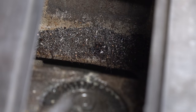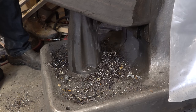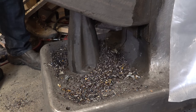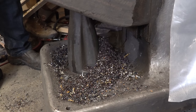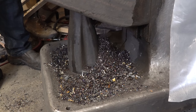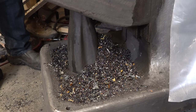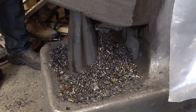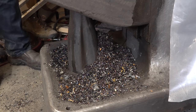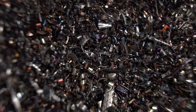I just started loading up with oil until all the grease came out. You can see the ways here have a little bit of that hand scraping left — that's what all these little flake-like marks are. That's important — it lets me know they're not massively worn, which makes me really happy. But here's what makes me really, really happy: this is essentially the entire history of this mill, stuck in the knee. It is just completely full with metals and plastics — there's even a little bit of wood in there. Found a dead guy. All the different colors, contrasts, and shapes — super fun.